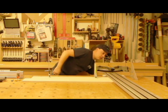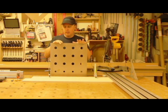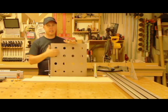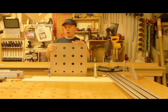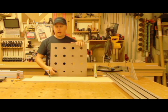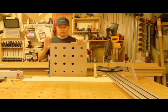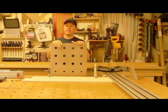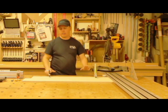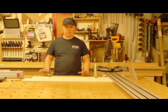Most recently, I actually had a chance to have some water jetting done, and I added this into the mix, so I made a template for my next one. Essentially, all my holes are four inches on center. These are actually made to the size of one of my bushings for my router, and then I have a set of 20 millimeter holes that I can drop a bench dog into, and then lock it into the last row of holes in order to keep everything straight and organized, and have a very square grid. Right now mine isn't, because of the way I did it. But you live, you learn, and hopefully you figure out a better way to do it. Or you get somebody with a CNC, and they can route it all out and have it perfect for you the first time.